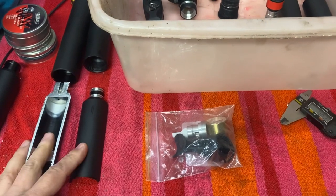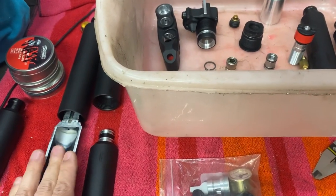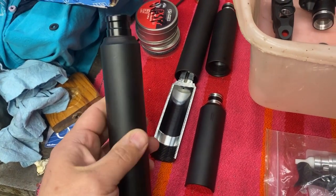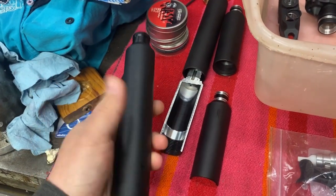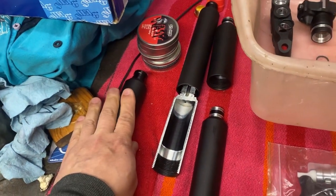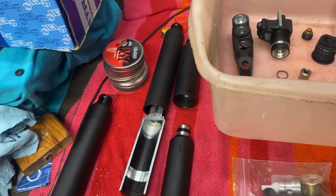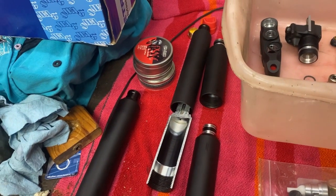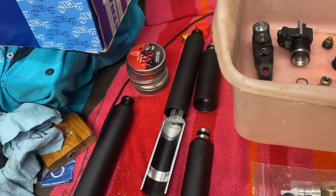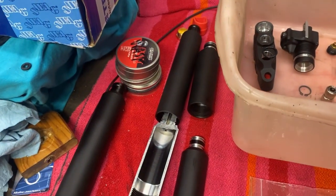And well, this was my part on this journey, and one cylinder is going to be exploded. Pressure tested to failure at some point by me, but I don't know when, because that is up to the point when I have use for the common rail pump. Then I'm going to test that. I'm just not going to put the pressure rig onto the lathe because it's too much work for one cylinder if I have no injectors to test.